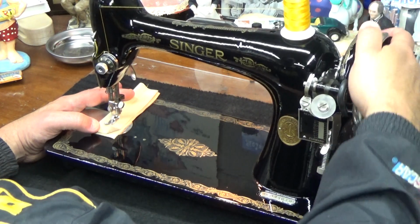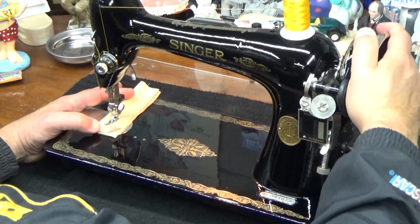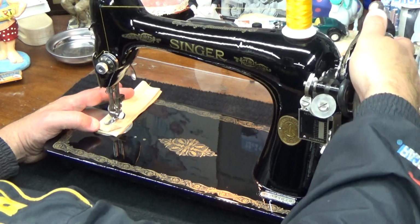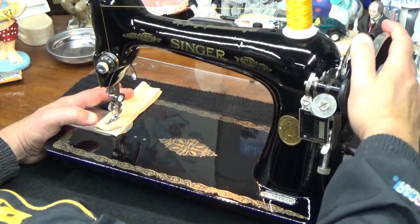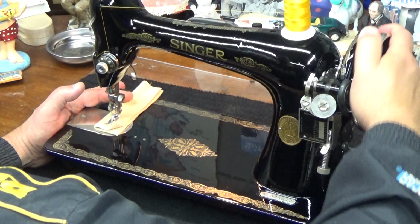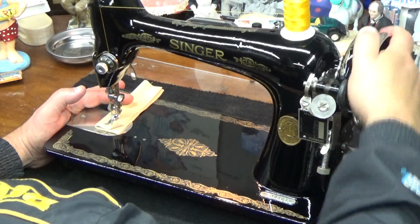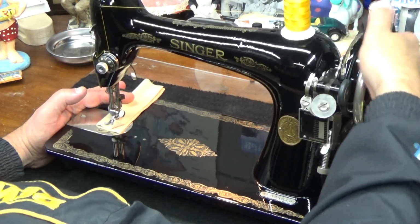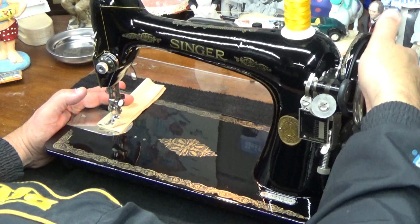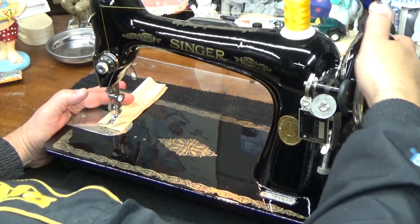As you're putting the bobbin into the raceway, you want to make sure that the thread is coming over the top, which means as that bobbin is unwinding and feeding the thread, it's going to be turning counterclockwise, okay? It's really essential that you set up the machine properly for sewing. It's really, really essential. We're almost there. Probably about 2 more stitches, 2 or 3 more. Last stitch.